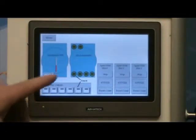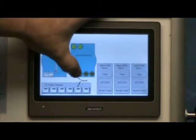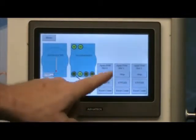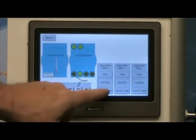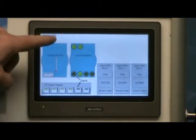For the 6160, you simply just touch the buttons. While there are no lights on the 6160, you'll hear the relays click on and off. And then finally, you have the different slots for the APEX — you can stop them, and you'll see the I/O below stop, then you can start them running again or reset the count. There are also relay outputs on the Siemens controller that can be controlled through this.